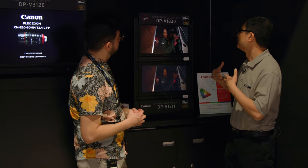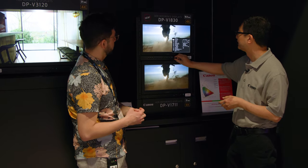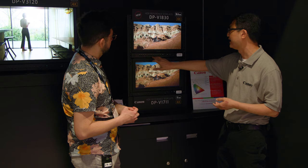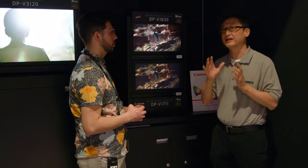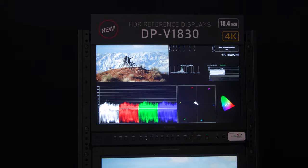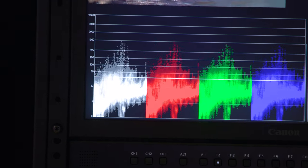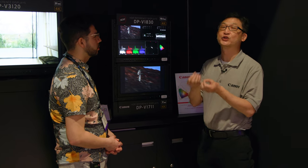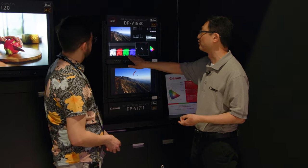For the DPV 1830, they introduced new firmware with a tremendous amount of new features to help you analyze your HDR or SDR signal information. There's a nice jog dial to go through the menus, and a set of eight function keys for quick access to the same feature set. To summarize what's been introduced: there's a multi-view information screen that gives you a quick overview of all the value-added tools built into the display — at no additional charge. There's an RGB parade, which is the latest feature, giving you an overview of color separated by channel to show the bias of your scene.